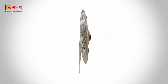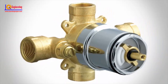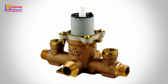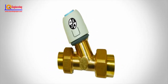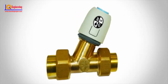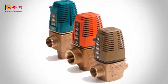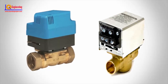Pressure balanced valve. Pressure balanced valves are used to maintain a constant temperature of water in domestic showers or bathtubs. A diaphragm within the valve allows the operator to set the mixing of hot and cold water. However, in the event of a pressure drop of cold water — for instance, if a toilet nearby is flushed — the diaphragm will shift to limit an excessive flow of hot water. Many jurisdictions require pressure balanced valves in domestic bathrooms and showers to prevent accidental scalding.